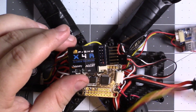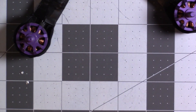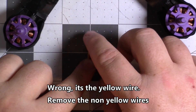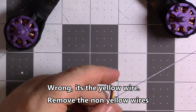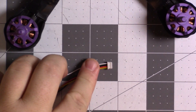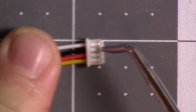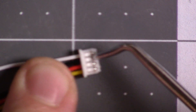So the way you do that — I'm going to zoom back out a little — is you take this connector and create the connector you need. It actually has it right now; it would be this white wire. So you could just clip all these, or the best thing to do would be to take a tool like this and pry up and remove. You look at it from the bottom — let me zoom in again. There are little plastic tabs; you just pry up underneath and pull the wire out, and the whole connector comes out.